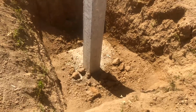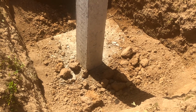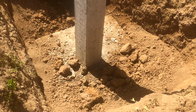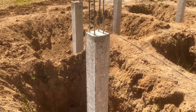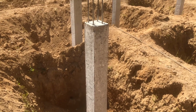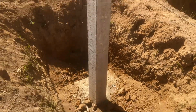So here you can see the concrete foot. In there is the square rebar we showed you before. That's been caked in cement, and it's had the rebar column fixed to it. That has then had casing around it, and we've poured cement into it and left the cement to dry. It takes about a day. What I've seen is they generally take the casing off after a day.